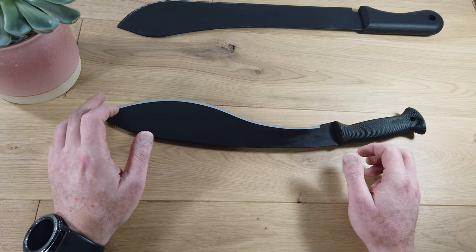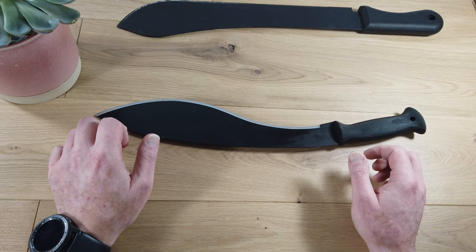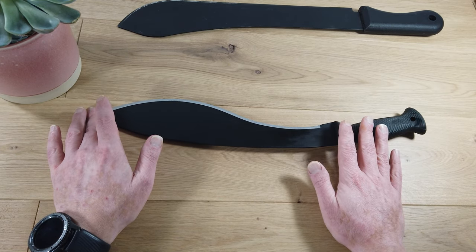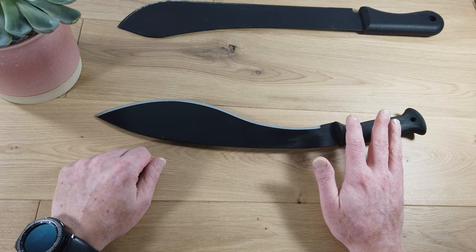There are a couple of reasons for that. Machete blades are stamped out of a sheet of 1055 medium carbon steel. They're then given a rough edge and shipped to Cold Steel in Ventura, California, where they run each blade through a sharpener to achieve what they call a good utility edge. This is not the same process as making the high-end quality knives that Cold Steel puts out. A machete is a heavy-duty, low-cost tool designed for chopping and clearing — they are just not designed for the same tasks as a knife.